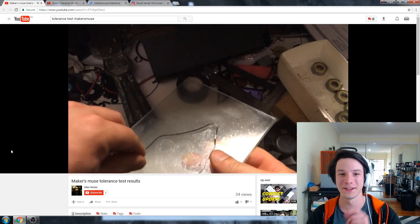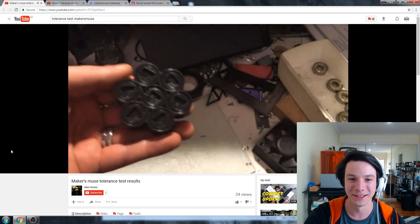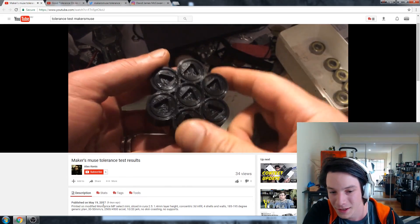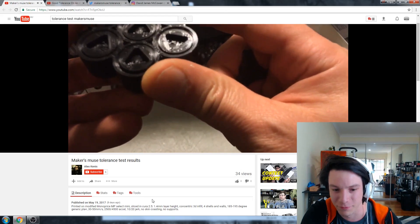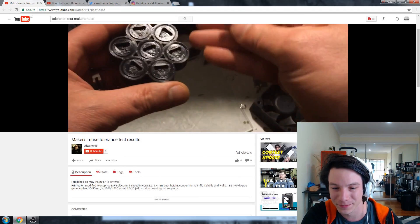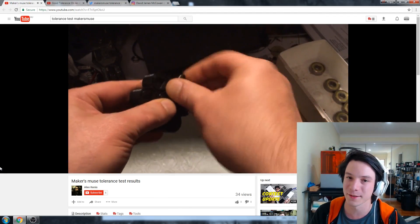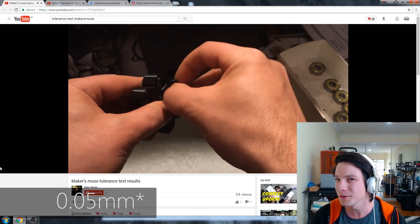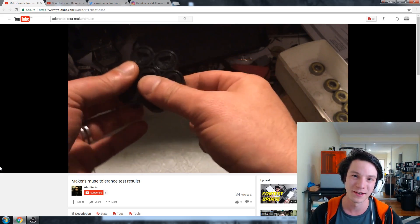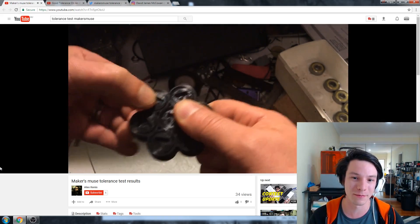Next we have Alex, and I love his video because he started with no cuts, no jump cuts — straight from popping off the bed to freeing it up. Looking at the description, he's using the Monoprice MP Select Mini sliced in Cura 2.5, 0.14 or 0.1 layer height with a 0.4 millimeter nozzle, running generic PLA Plus. By the looks of it he's gotten them all free, which is darn impressive. The 0.05 should theoretically be impossible due to stepping of the 0.4 nozzles — maybe a 0.2 nozzle would work, but I think this might be a case of the slicer settings. Cura may be doing something.